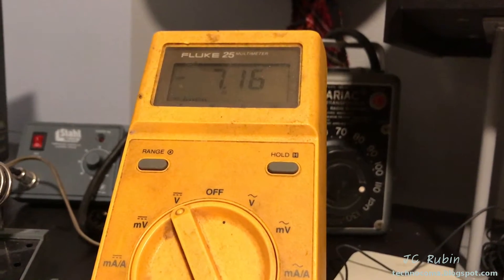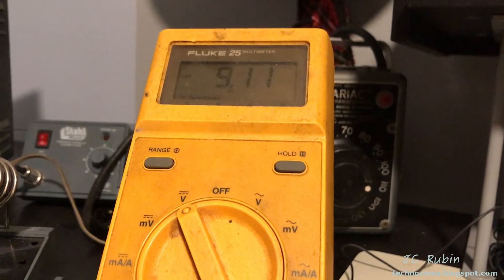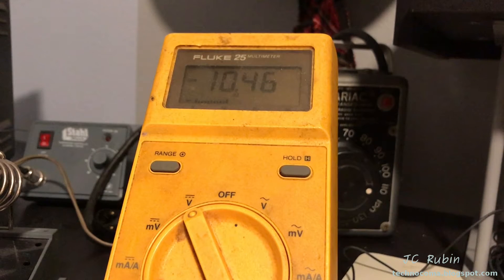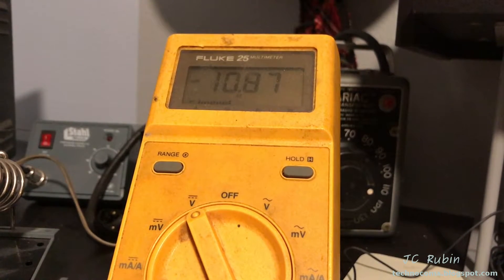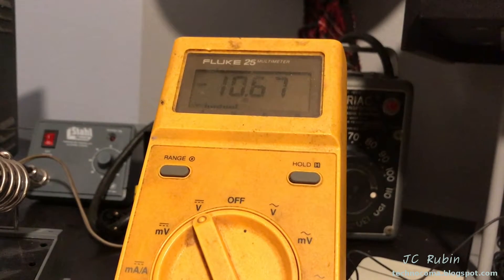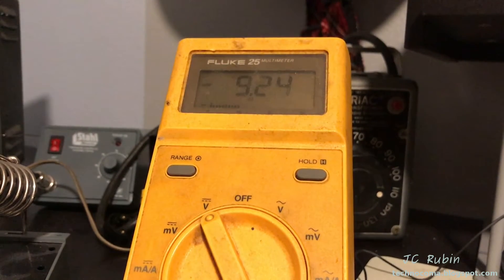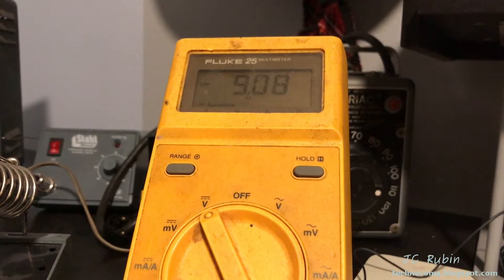We're getting more negative voltage — we're at negative 7, negative 8 volts now. I could get up to negative 9. I'm passing the station now and it's dropping back down. The strongest I was able to get on the dial is about negative 10.8. So it appears that this is working. I wouldn't expect the voltage to become more negative — I would expect less bias and let it flow more, but I don't really understand. I'm going to have to look at the data sheet for this tube.